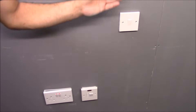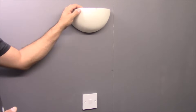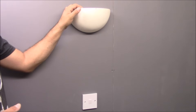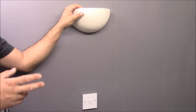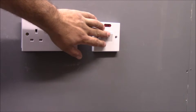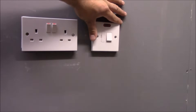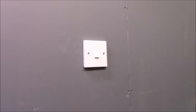You can't connect the lamp through the switch straight to the socket outlet. In the future, if someone wants to change this lamp into something more modern, they'll obviously turn off the power at the consumer unit and switch off the 6A MCB connected to the lighting circuit. They won't be aware that this is connected to the socket outlet. And they can easily disconnect both the neutral and the live in the FCU when they switch this off, because this is double pole — it also cuts neutral and the live. And this switch, the light switch, it only cuts off the live wire.